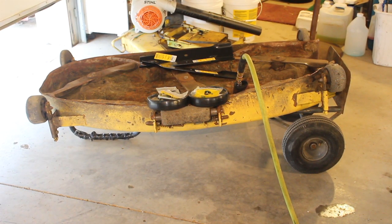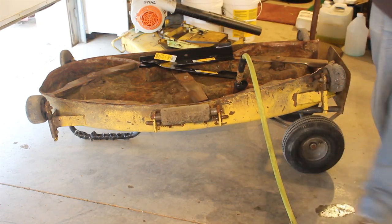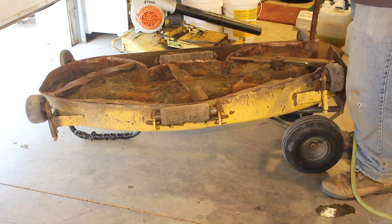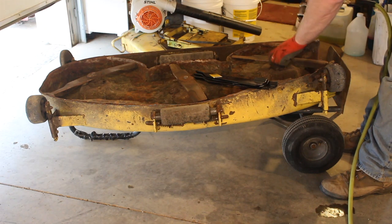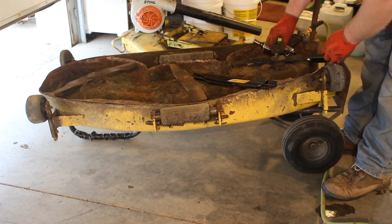We're going to start wrapping up this 318 project. I've got the deck turned over and already scraped. What I'm going to do next is change the blades, and after that we'll replace the rear gauge wheels. I've got new bolts, new wheels, and the rest of the hardware — the washers and everything else. I've got my impact out. Here are the new Stenz blades. Now remember, if you have a deck upside down, make sure to mount the blades correctly — last thing you want is to mount them incorrectly.